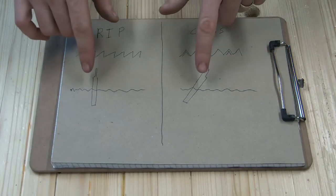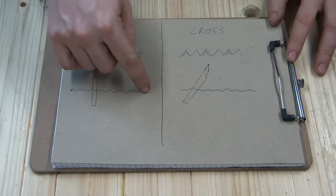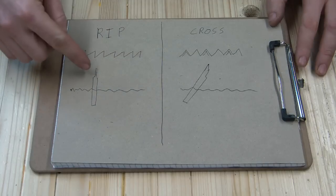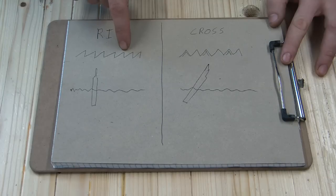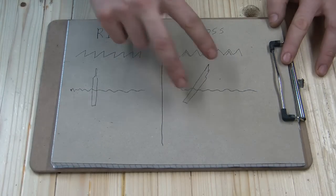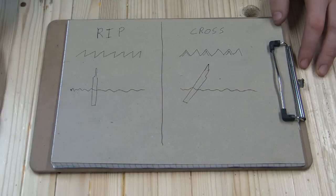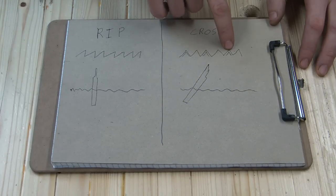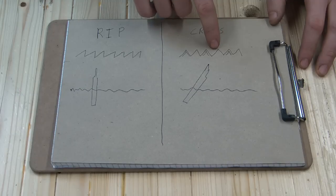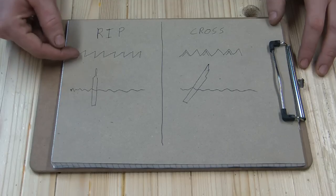So a rip saw is basically a bunch of chisels in line, so that as they go through the wood, each chisel is running down the line. Whereas a cross-cut saw is a whole bunch of knives in line, and as it goes down, it has all those knives cutting the fibers. The way this is done is by how the file is run across the blade. So if your blade is going this way, then with a rip saw, your file will be going at 90 degrees to the blade, giving you a flat edge on the front of every tooth. If you're with a cross-cut, it's turned at an angle. What that angle is, different people have different things — I've heard as little as 10 degrees and as much as 45 degrees; I like about 30, though most people prefer around 15 to 20 degrees. Having it at an angle to your blade gives you a point every other one on every other side, so you're cutting two lines as it goes through. Whereas with the rip, everything is in line in the same plane.